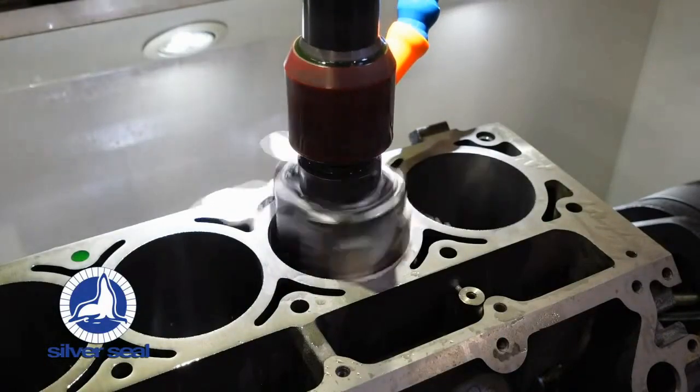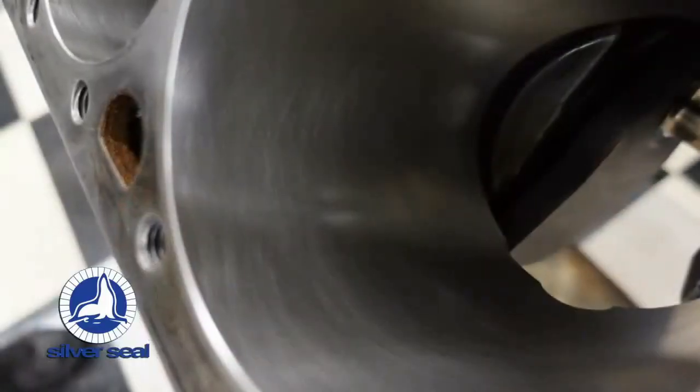Now, tell everybody how that impacts crosshatch angle, because we know crosshatch angle is really important in terms of how the oil moves up and down. Right? You guys know it. Oil is one of the elements in our ring seal soup, and crosshatch angle is that transport for the oil. So, Ed, explain what we're seeing and why that's different than just the regular roughing mode where it just starts spinning and does its thing. Right. No, that's a great catch, Lake.